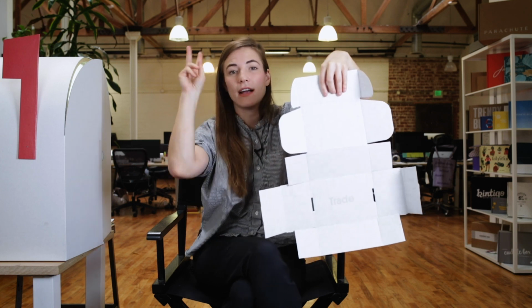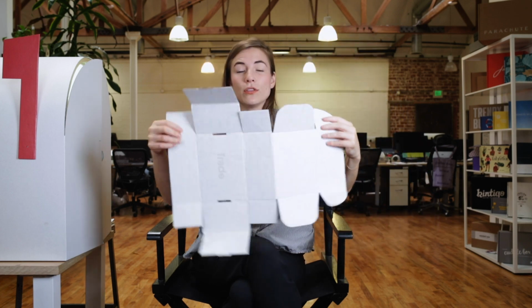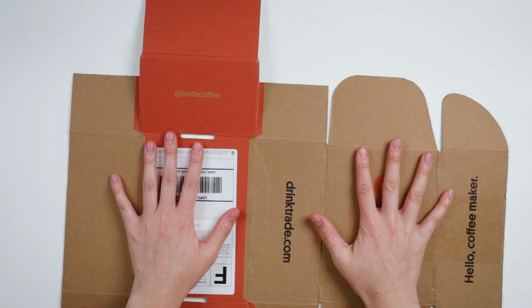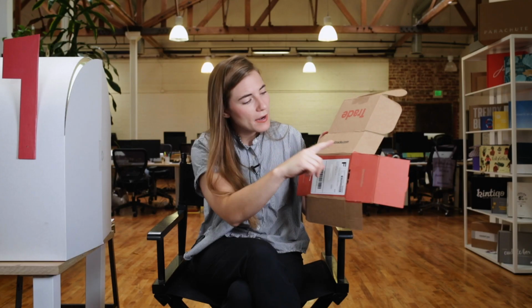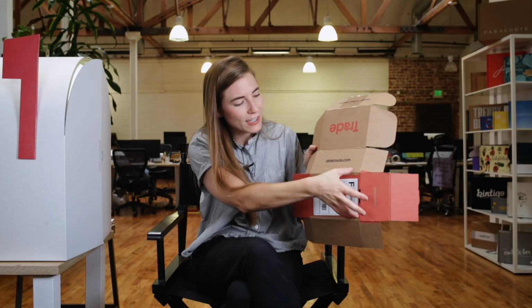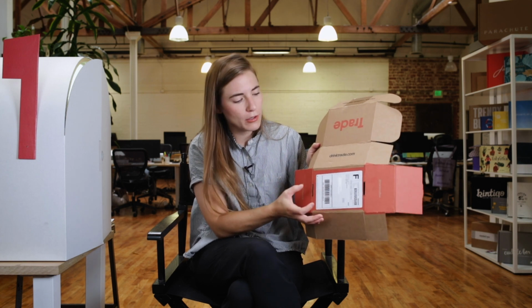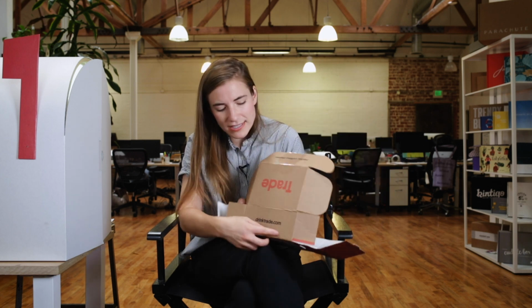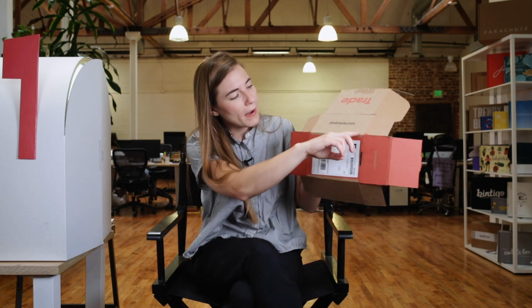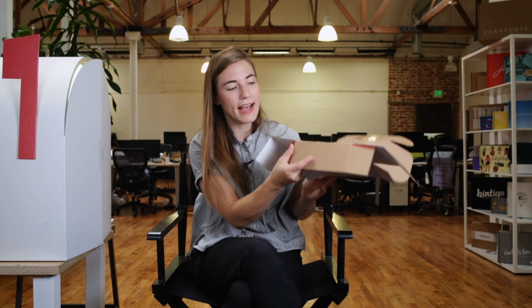Now, the corrugate that does get kind of quote unquote wasted in a box facility is recycled and reused, but it's still kind of interesting to note that when you flatten a box out, you can see how efficient its shape really is. This is kind of a small detail, but I just want to note how they carve this red color in along the bottom so that it's actually not trying to flood coat this entire bottom panel. And that's because they don't want to have to be too careful about the registration, because when you fold the box, they don't want you to see any red on this panel. So by cutting it in and giving themselves some wiggle room, it just looks like the red panel is framed on the bottom, but they don't have to worry so much about the red bleeding over the edges to the other sides. Thumbs up to prepress on this design.